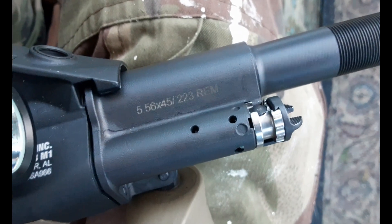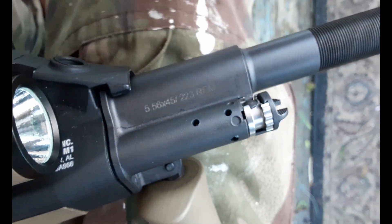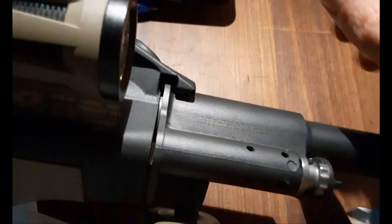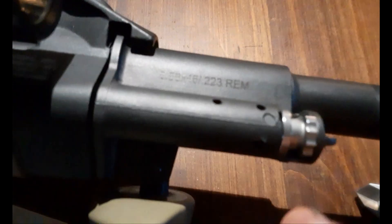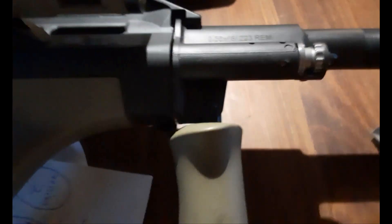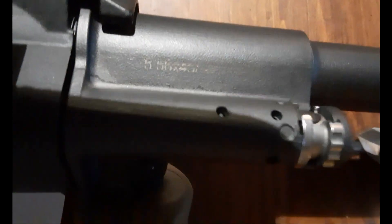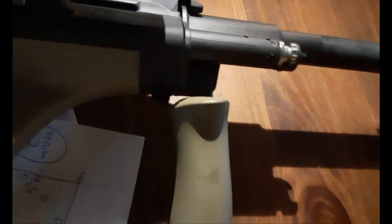Now, the big topic I want to cover involves misinformation concerning the suppressed version of the gas plug. There are two types of gas plugs you can get: the factory original and the suppressed one. I've installed the suppressed version of the gas plug, and this is the factory original. They look identical from the rabbit ears end, but what's different is that they have completely rearranged the orientation of the gas port holes around the internal cylinder. There is zero information when you buy a suppressed gas plug about what the different settings are, zero information about the design behind it, zero information about the diameter of the gas holes. So what I've done is taken digital calipers and measured all the holes on both the factory gas plug and the suppressed version.